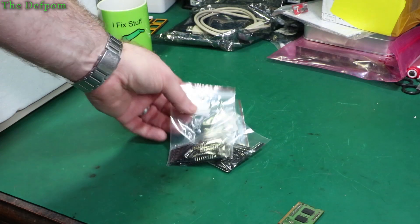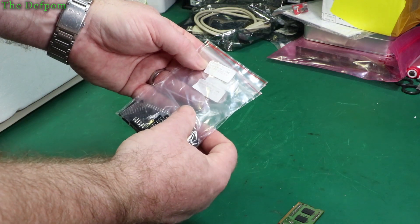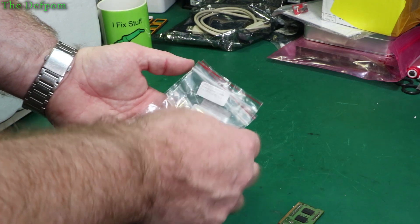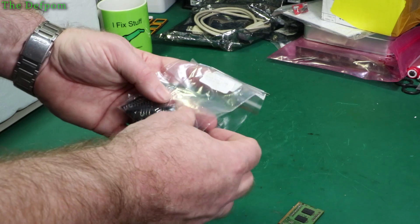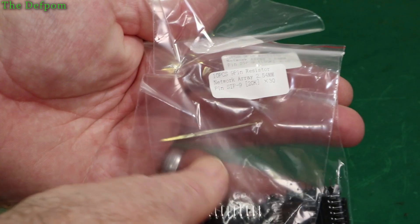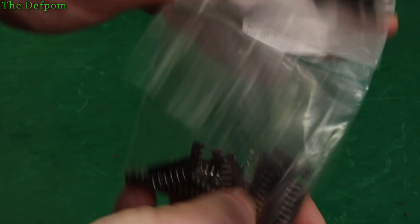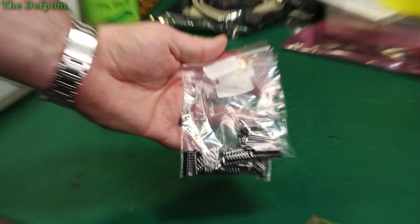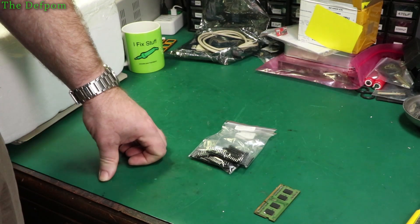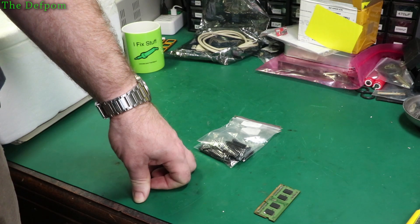This is a bunch of resistor arrays. I've got these on my project — it uses some resistors. We've got 10 pieces, 9-pin. Now, annoyingly, I've now gone from 9-pin down to 8-pin, so these aren't going to fit. I've got 47k, 20k, and 100k. I'm trying to have some very loose pull-ups on some pins on my ESP32 project, because not all the input pins have pull-ups on them. Some of the GPIOs don't actually have internal pull-ups, which can catch you out if you're not careful.